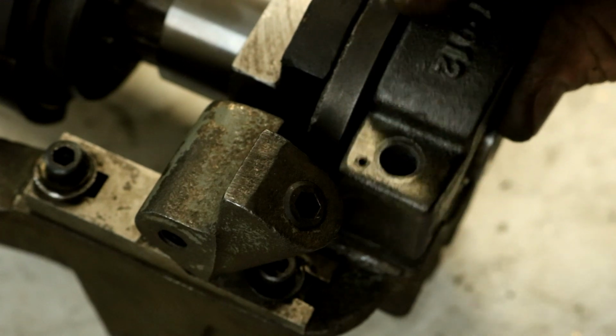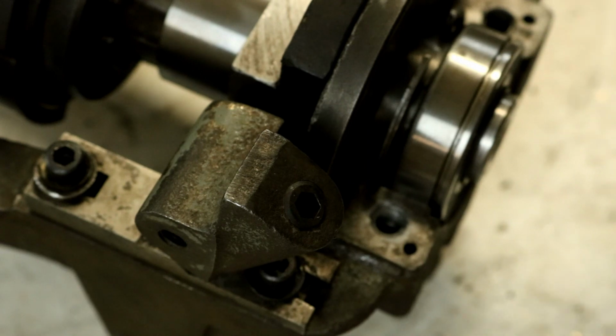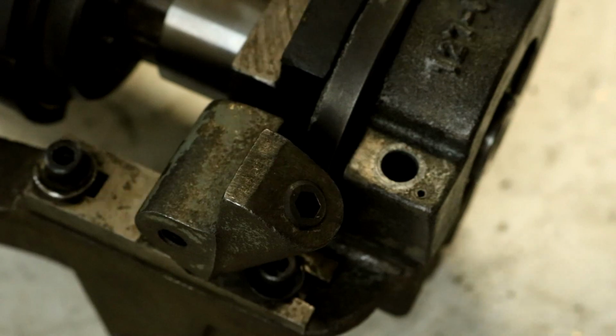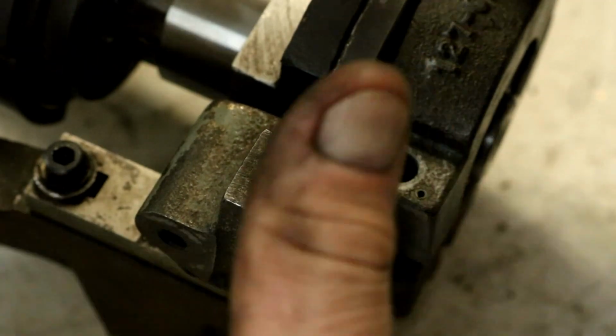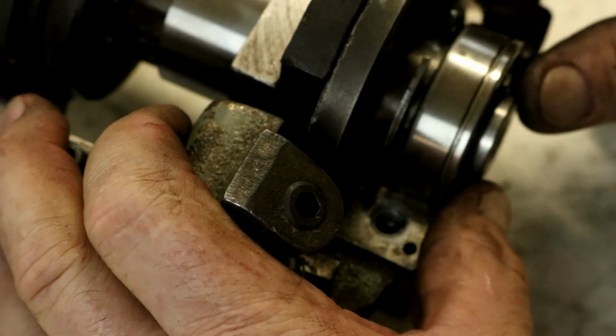It's a real pain. So I'm going to put this on now. This way. There's a couple locating pins. I'll put this on now, but I'm not going to put it tight because we have to loosen the other end to lift it to slip the belt in once you have this all in place. So we'll just get this in here and started.